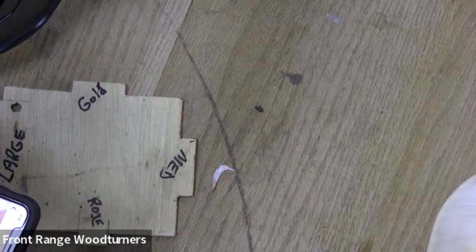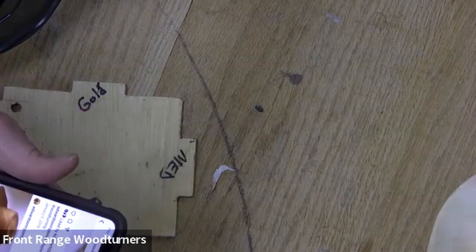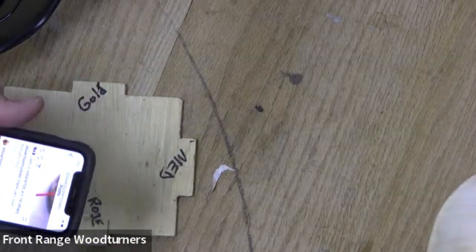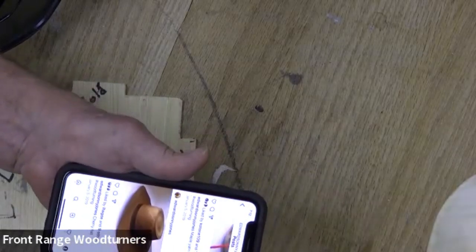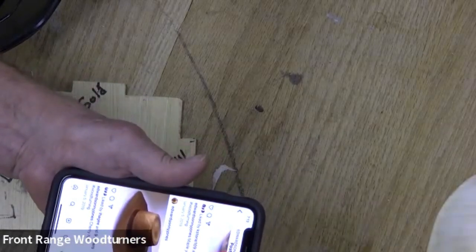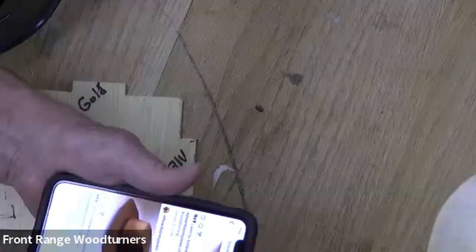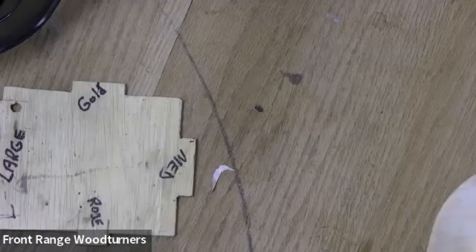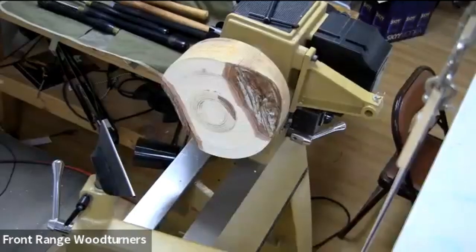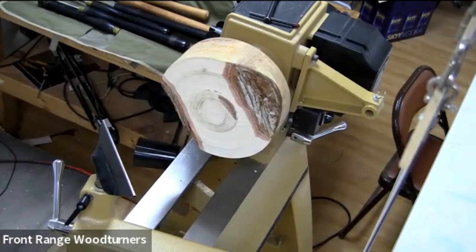This one, piece of wood from New Jersey, piece of black cherry that, and if you look, we'll get it. There you go. And I apologize for the glare. But if you look, the band around the hat is dark because I was able to burnish that. That wood got a little dry on me as I was turning it. And because the wood became a little drier, I was able to take a piece of Paduke or Purple Heart or Red Heart, and you rub it against, as it's spinning, you hold it against the hat band, and it will burnish, and you can color that.